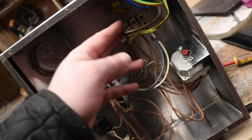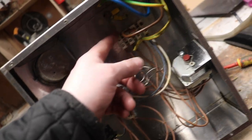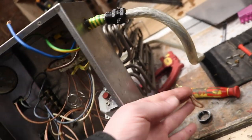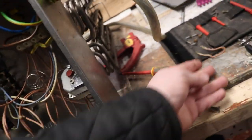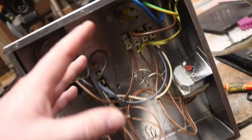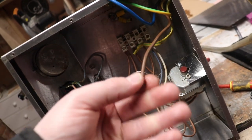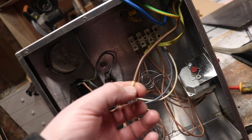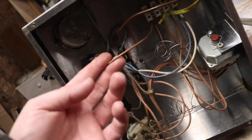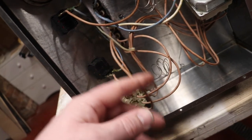We've already got that configuration with all these cables, and what the original installers had done was just couple up L1, L2 and L3 with a few pieces of wire to bridge the gap, meaning the whole six kilowatts of this system was running on one cable. So that cable had to be four millimeter square or so to carry that current, but you can see inside we've only got 2.5mm cables running from one side to the other.